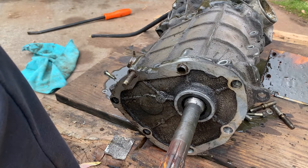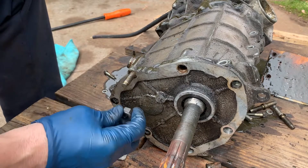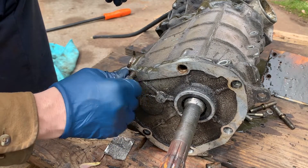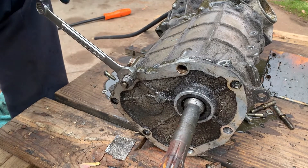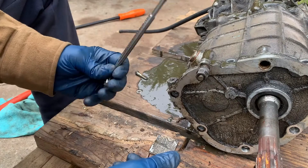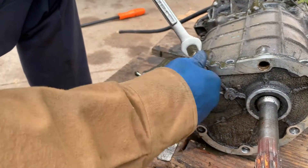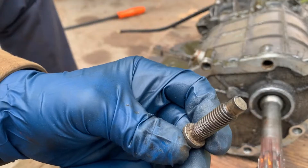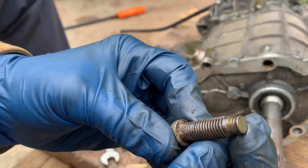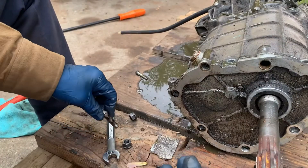Most of what I've shown you so far is kind of the wrong way to do this stuff — I'm also not trying to save any of this, unfortunately; nobody wanted to buy it and it's of no use to me, so I'm scrapping it. If you have a stud that doesn't have a provision for removal, take two nuts and back them onto each other — which I'll show you here in a second — get them so they're tight, and you can tap it off with a hammer. With a longer or double wrench you can pull them off; it's easier for me to just hit it with a hammer and the stud will come out.